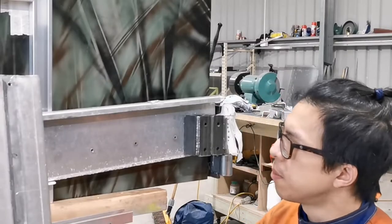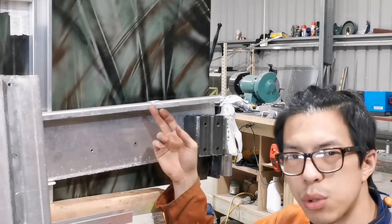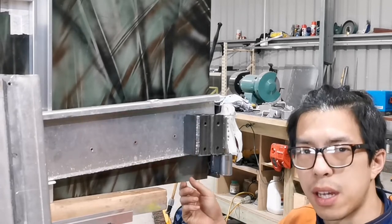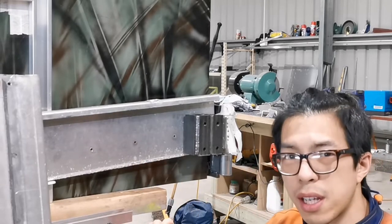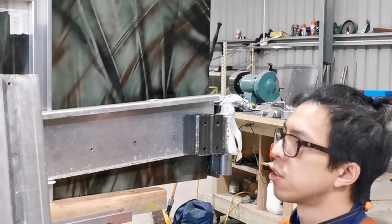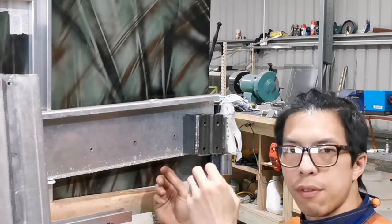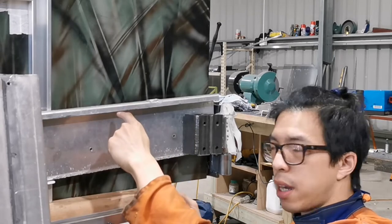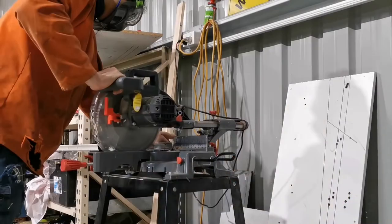Now, the size of the arm, I believe it is 200 mil by around 25 for one piece, and this is actually 4 mil thick aluminium, so it's a really strong structure, very difficult to cut as well. So I'd say it is also mechanically strong enough to hold a spare wheel. I'm going to double this up, so at the end it will be 4 mil aluminium, 200 wide plus around 50 to 60 mil depth.